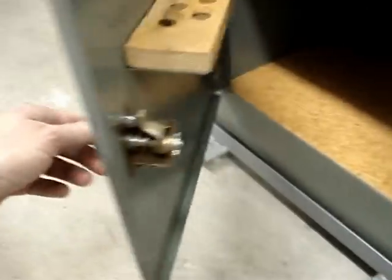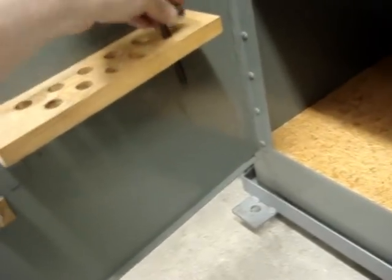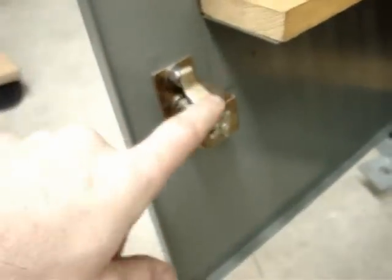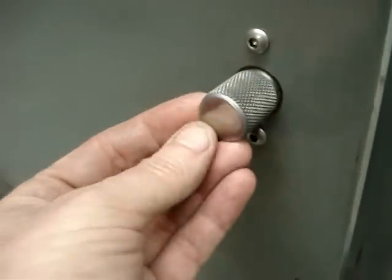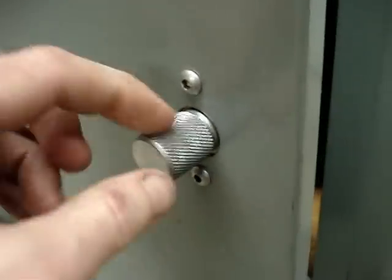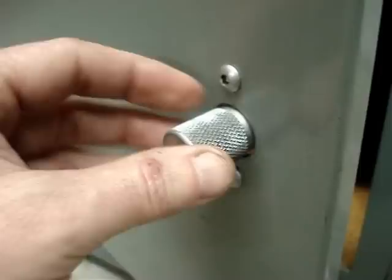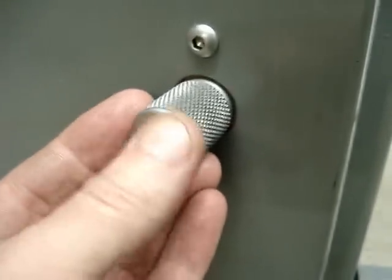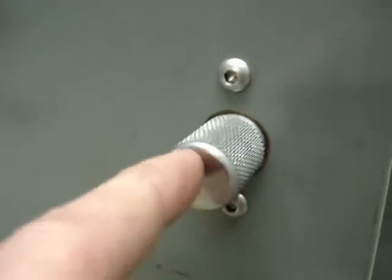The only other thing I've done recently is a little work on the latch. The inside is pretty clean — I've got the draw bar wrench in there. I took the latch off the other day; it was very dirty but I was able to clean it up. I still have a little sanding and polishing to do. I pulled it off and submerged it in Evapo-Rust for about a day, then used a wire brush to clean it. On the front, which originally had a satin chrome finish, I took a metal file and knocked off the finish, then sanded and polished it.